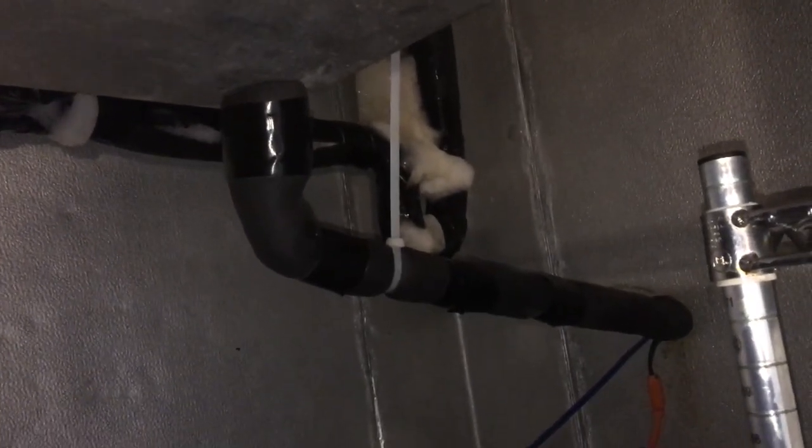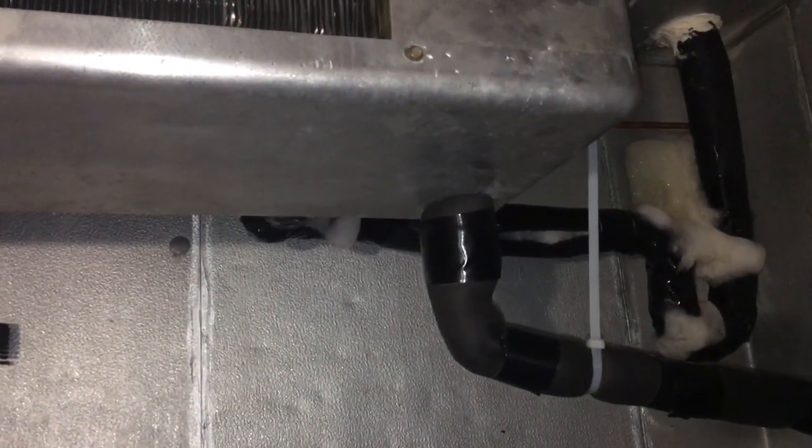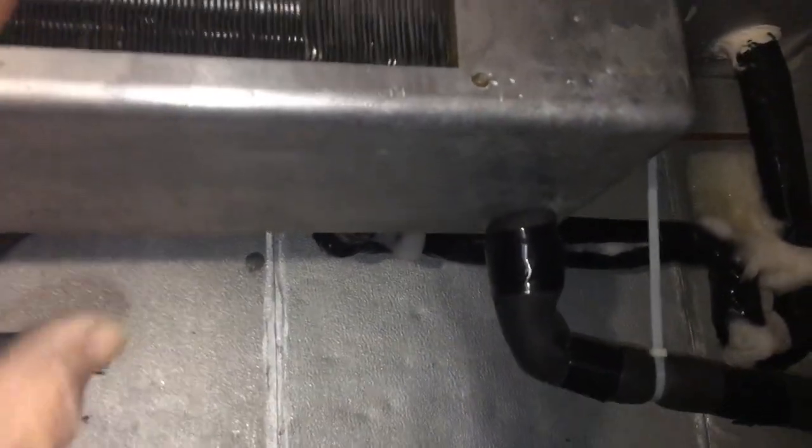Let me get this thing back together. I had another little heater on the truck, so I added a drain heater and re-insulated. I didn't have any plumber strap but I had a pan to it, got that strapped up so that gap won't come down — to make an air gap. Hopefully it'll heat up and not ice up anymore. Drain pan is good, heater is good. I'll break up the remaining ice with my mini sledge and clean this up. There it is — all done.